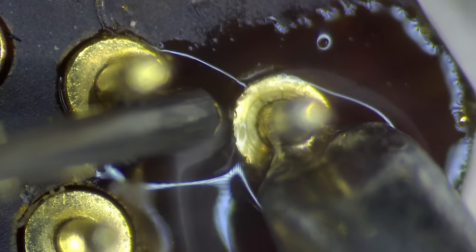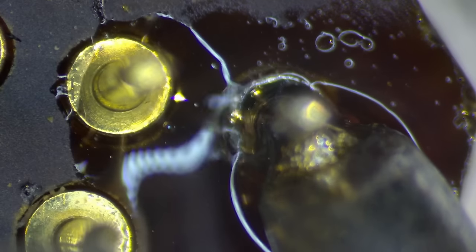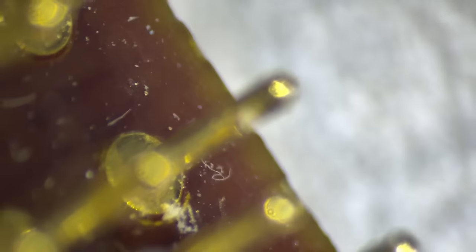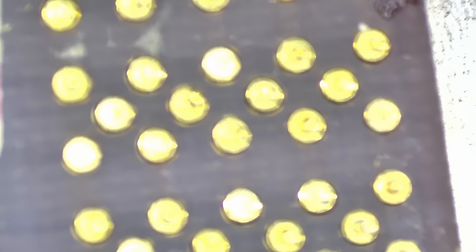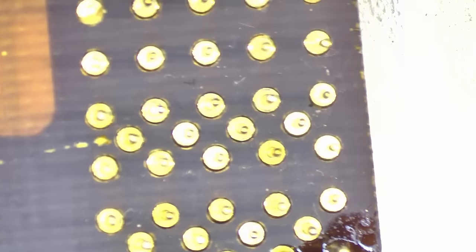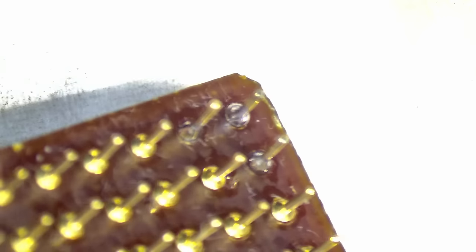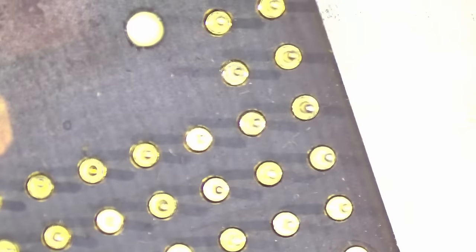And that's it. When they're still attached it's not that bad — I can manage to get this pin reattached. The solder is just at the base where I placed the soldering iron and the pin looks good. I think I've soldered most of the other pins now and straightened the rest. There's one still missing, so we still have to get a donor from the Pentium 3. Wow, here's also one missing — so the original pins that I discovered were missing are still missing. We have two more pins to go and the rest looks more or less decent now.